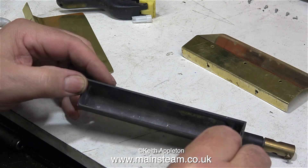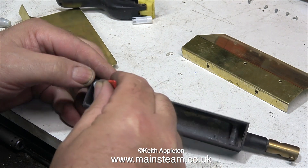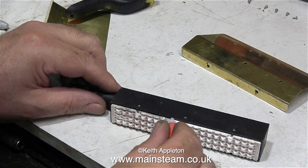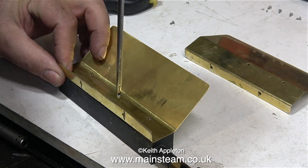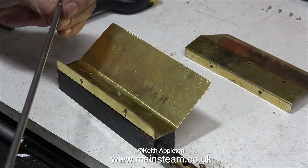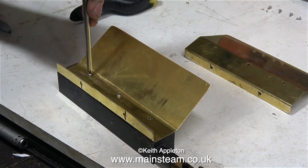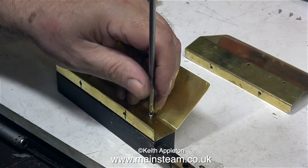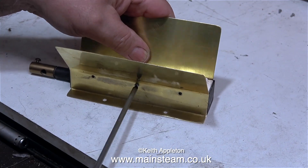The next part is to apply some super glue to the actual body of the burner, which should help support the damaged ceramic. Once I fitted the piece of ceramic back into the burner, I ran some super glue around the edge for further reinforcement. Before fitting the pieces of brass to the burner using the original screws, I took them into the outer workshop, put them in the vice, and bent them at about 30 degrees — that's why I scribed the line using the burner base as a guide.